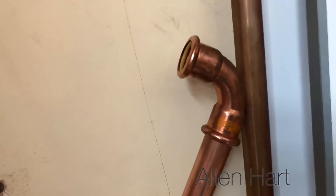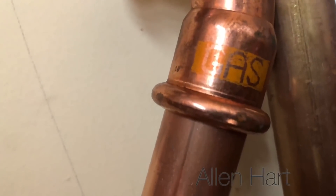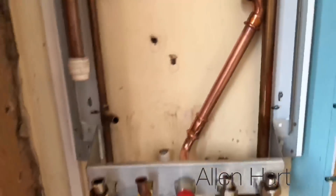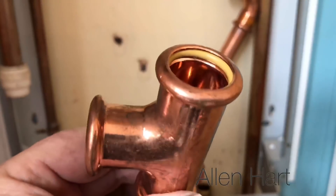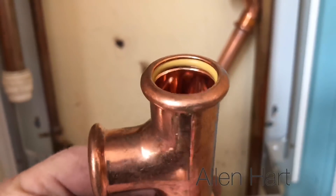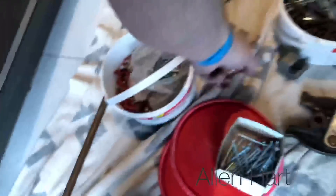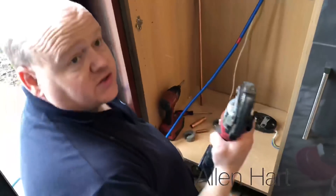So I'll just show you — we're using press fit today. This press fitting here is for gas; if you have a look, it says 'gas' on it. As these get a bit older, and even sometimes now, that wears off and it's a bit hard to see, which if you go to it on an inspection afterwards might be difficult. But when you're installing, if you look inside, the gas ones have a yellow o-ring and the water ones have a black o-ring.